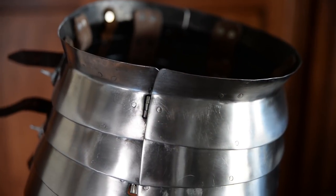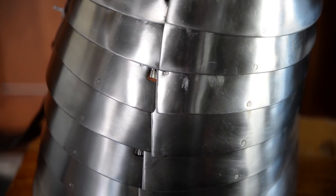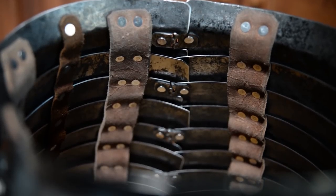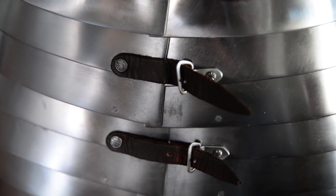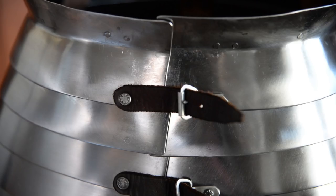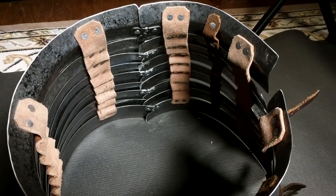The assembly has hinges down either side — there is a hinge on every other row of lames — and that's what permits you to open it up and actually get yourself inside the armor. The back of the armor is closed using a series of straps and buckles, consistent with what we hear in the documentary sources and what we see on visual representations of similar configurations of armor from the time. You'll also notice that the way it closes in the back creates this lattice of interlocking overlapping lames so that it doesn't gap. The whole thing is permitted to move by a series of internally mounted flexible leathers riveted to each row of the lames.